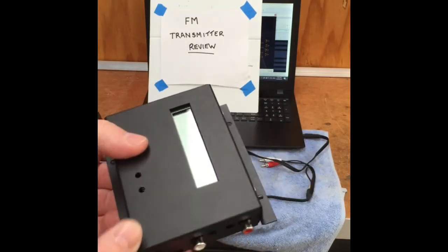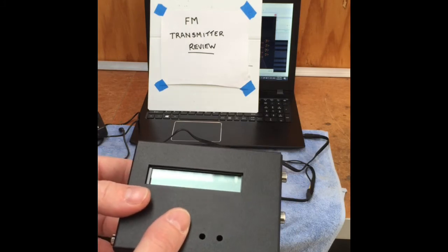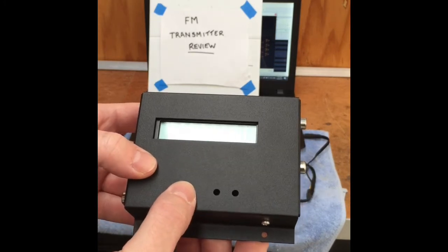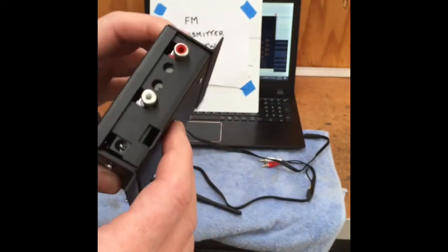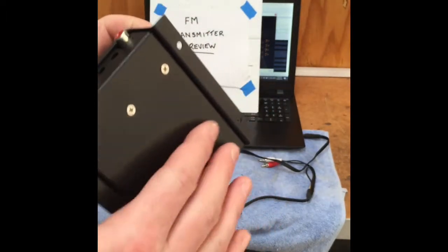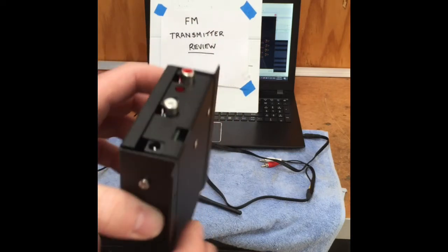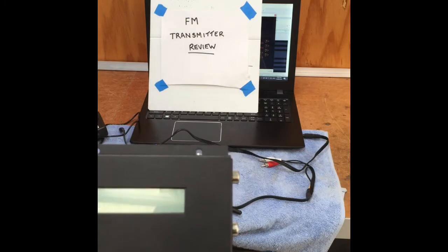The EDM transmitter is a little bit different to the earlier one I was talking about, the CZE-7C. It's not a direct plug-and-play — you do have to do a couple of little jobs when you receive it. It comes with some really good instructions on what you have to do, which is mainly fitting the power supply plug. You pull the four screws off the outer case, which releases the board, and it's a simple matter of soldering the power jack in.